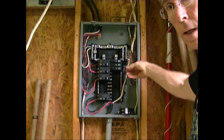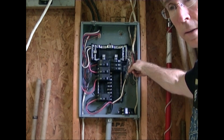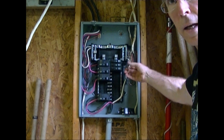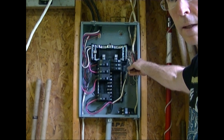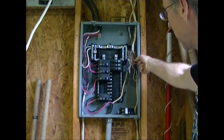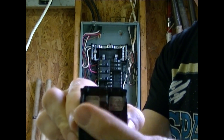White is neutral and is 120 volts from either one of the hot wires. In this circuit, I won't be using the white wire because it's 220 volts — there's no neutral line used, no 110 needed at the other end. I'm going to wire the white on this end in case there's ever a need at the other end. The bare copper goes to the ground bar up here along with the white, and then the red and the black go to the two sides of the breaker. There are two terminals in this breaker — red and black can go to either side.